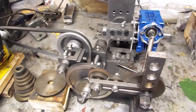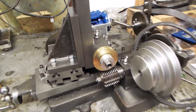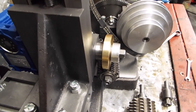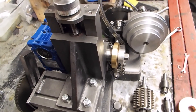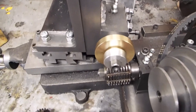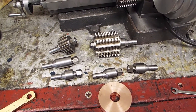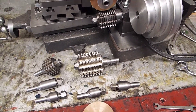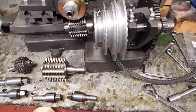I thought we'd give you a view of the other side of the machine. You can see the hob blank — the gear blank — that's set up there. As you can probably tell, it has to be angled at an angle which is the sum of the helix angle of the hob that's cutting it and the helix angle of the worm it's got to fit with. That's a lot of maths; we tried and I think we got it right. You can see the hob there underneath, and you can see the arbors and another blank — two other hobs there. You get one hob for each size of gear, so that's 20 DP that's on there, and those are 16 and I think 18 DP hobs there.